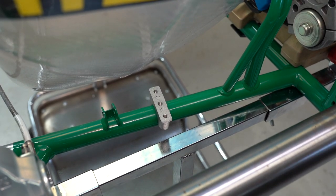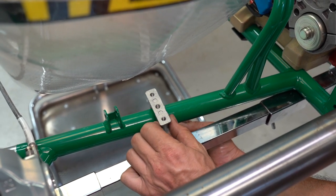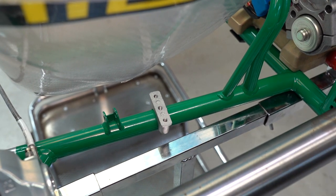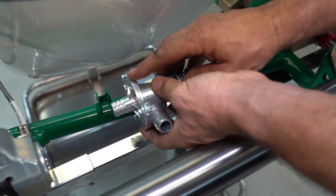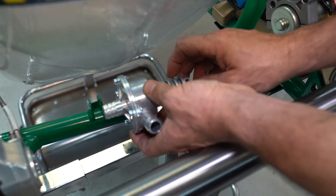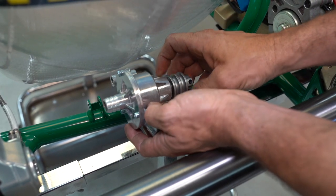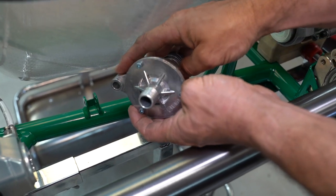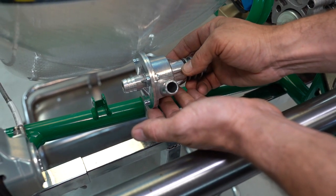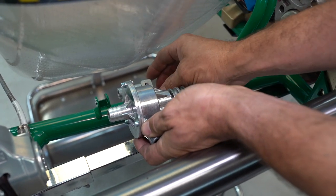The first thing we're going to do is install the water pump bracket — it comes supplied with the kit. I'm going to put it about here in the center of the chassis rail. You've got to be careful when installing the water pump that the housing clears the spine of the seat, otherwise you can sometimes run out of belt tension because this pivots on the mounting bolt down here. If you mount it exactly there, you kind of run out of room to get tension on the bolts, so just keep that in mind.